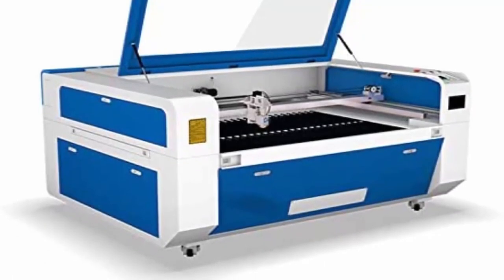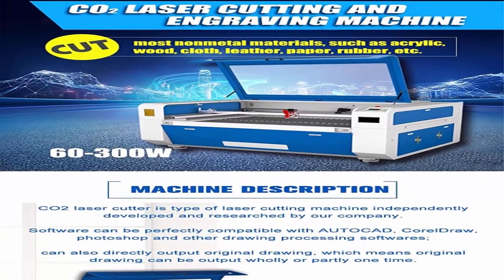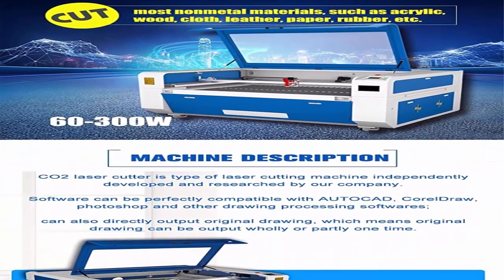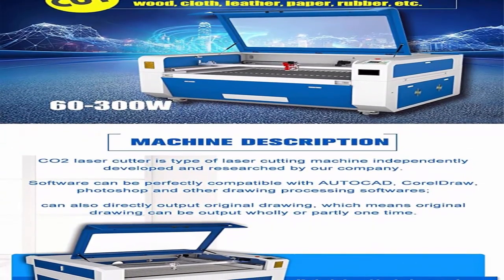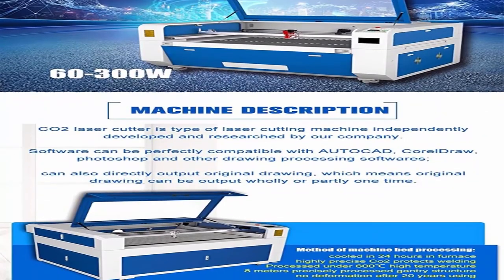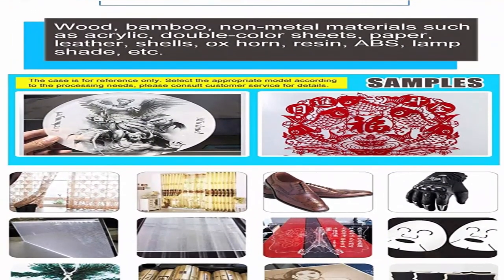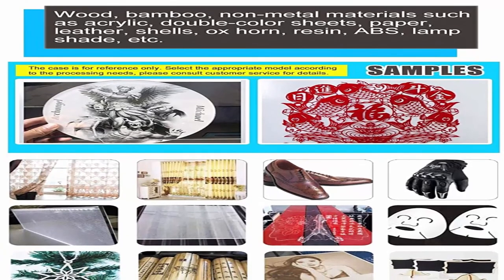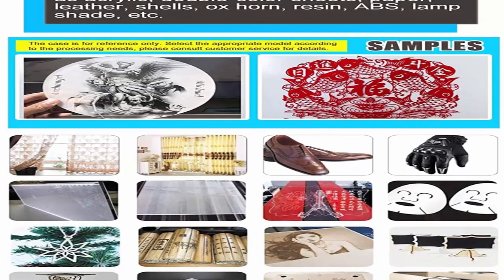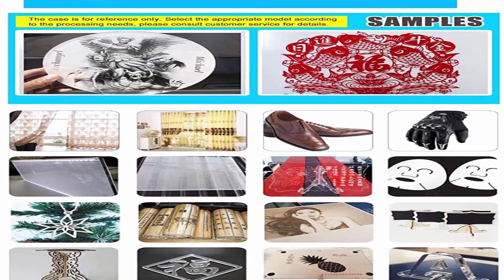Parameter: peak power, 175.7W. Agreement laser power, 150W. Power range, 150W to 180W. Engraving area, 1300 x 900 mm. Max engraving speed, 0 to 60,000 mm per minute. Max cutting speed, 0 to 5,000 mm per minute. Repeat positioning accuracy, plus or minus 0.01 mm.